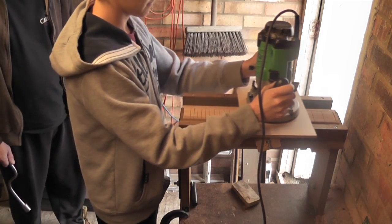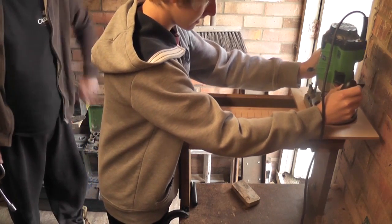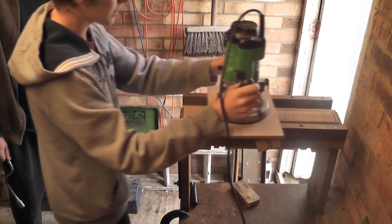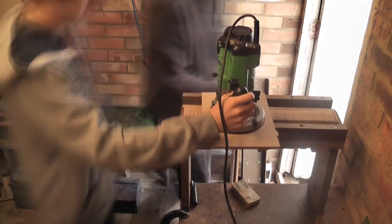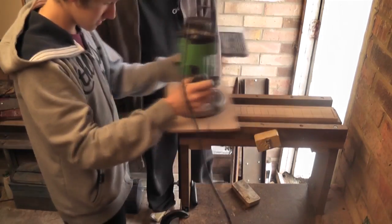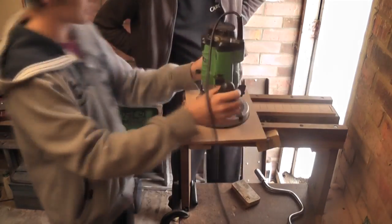Because the bolts that we're using, like a lead screw, are a standard metric size, we know the pitch of the thread. This means that we've worked out that for each cut, all you have to do is turn the bolts a whole 2 turns. 1, 2, and route. During this time-lapse, watch how the fretboard arcs as we move it along. I take the thin cut, move the router to the side, and then turn the bolts a whole 2 turns. The whole thing takes a total of 20 turns, and the 10th one, of course, sets the workpiece in the middle and routes it parallel with the side rails.